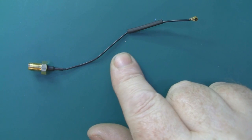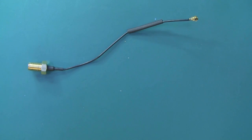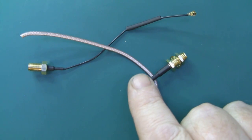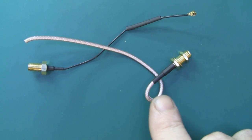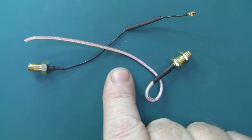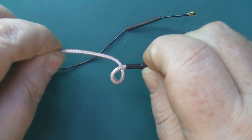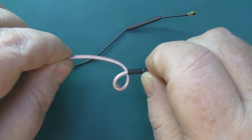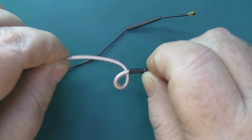I'm using this because the solder pads are so small on the little analyzer. You could use a larger coax and get away with it if you've got good soldering skills. But remember — don't cut it too short to attach to your dongle. Try and loop it around a little bit so when you do cut it you've got some length to spare. If you do something wrong and cut it a bit too short, you can still pull on that loop to get it in place.